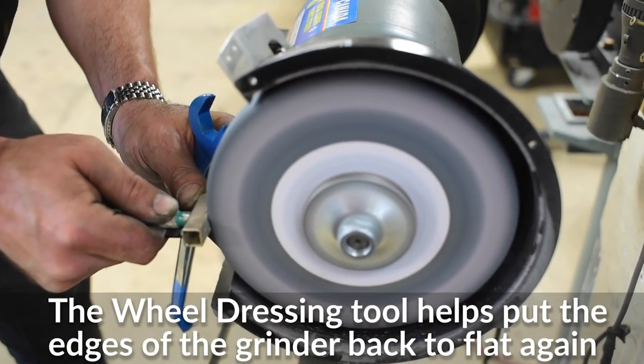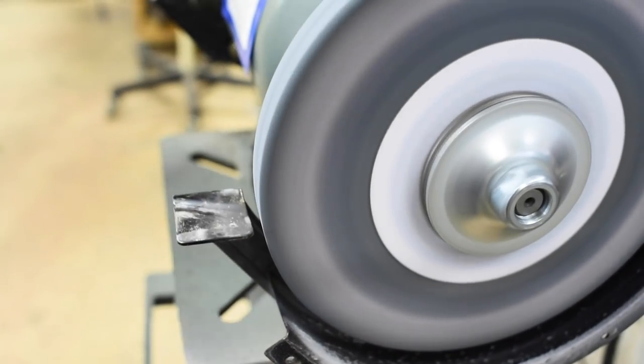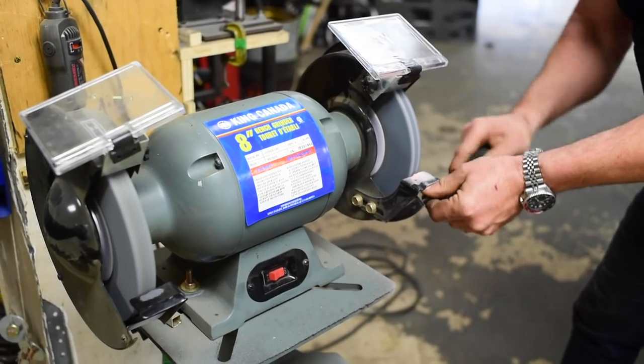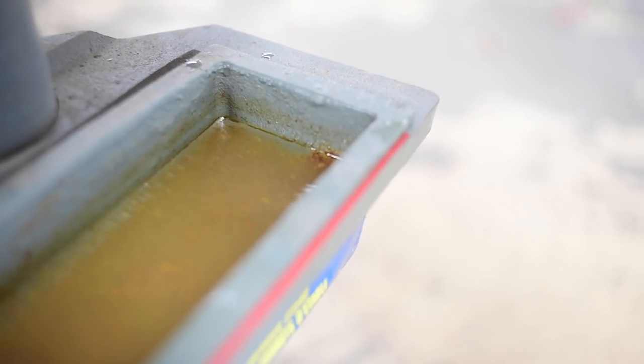I hope this is going to help some people out there, because again, a bench grinder is a totally ubiquitous thing. So many people have one in their garage or their basement, and rarely are they all that useful because you flip them on and they start shaking. You can make a set of balancing flanges — there are actual products people make for balancing wheels, but making just one set of flanges, if you've got any metalworking stuff around, is the easiest way to do it and allows you to balance a whole bunch of stuff really cheaply. It's a really good process to learn because it's applicable to so many other things.